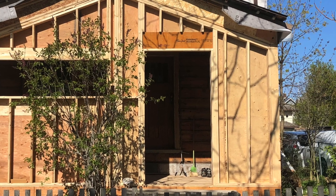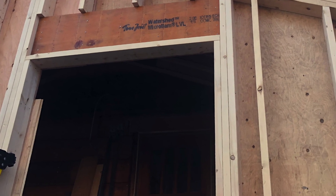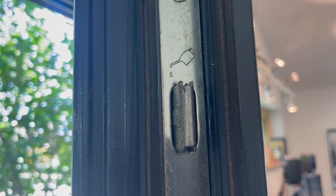It provides privacy on the inside while still letting light slide in, and you can still peek out. One thing to be sure of when installing a door like this is that because of the weight of the sash it can really impact how hard it slams, so you need to make sure the frame around it is nicely beefed up. I have triple studs on the outside of that just to make sure there's lots of wood behind it to screw into. It closes very nicely and you don't need to slam it at all. When you lock it there are three locking pins across it — in my opinion it's probably easier to break in through the wall than it is to break in through the door.